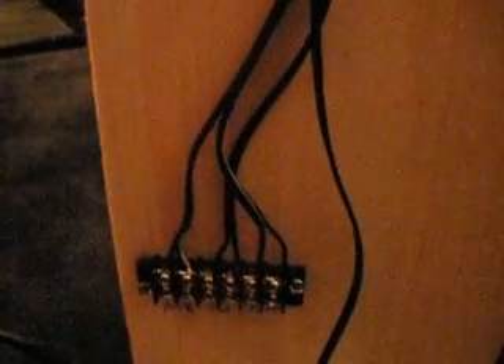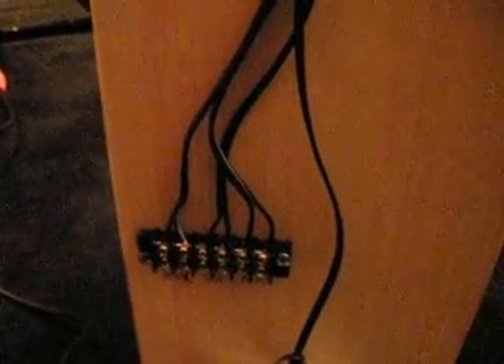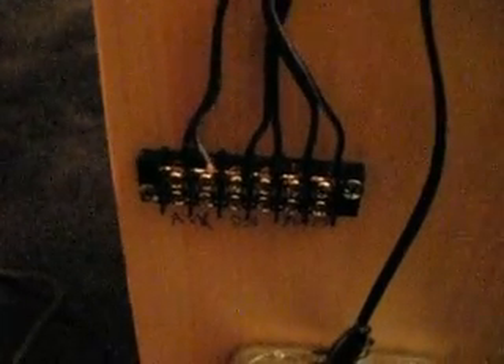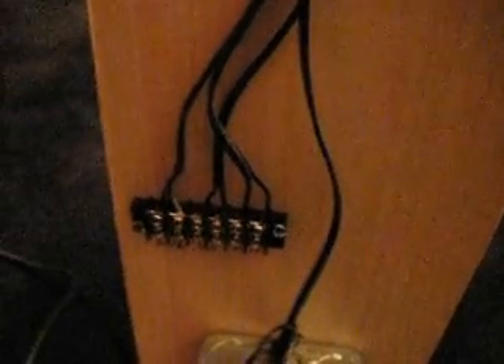Right here I have my terminal bridge and the pull stations and the trip wire wire into this, and then it has an output to trip the rest of the systems I have that I've built. It also features an auxiliary switch in contact via the two last terminals on the left that's switched on and off. Basically the circuit opens and closes with the relay. And I'm going to ring the bell one more time. And that's it.